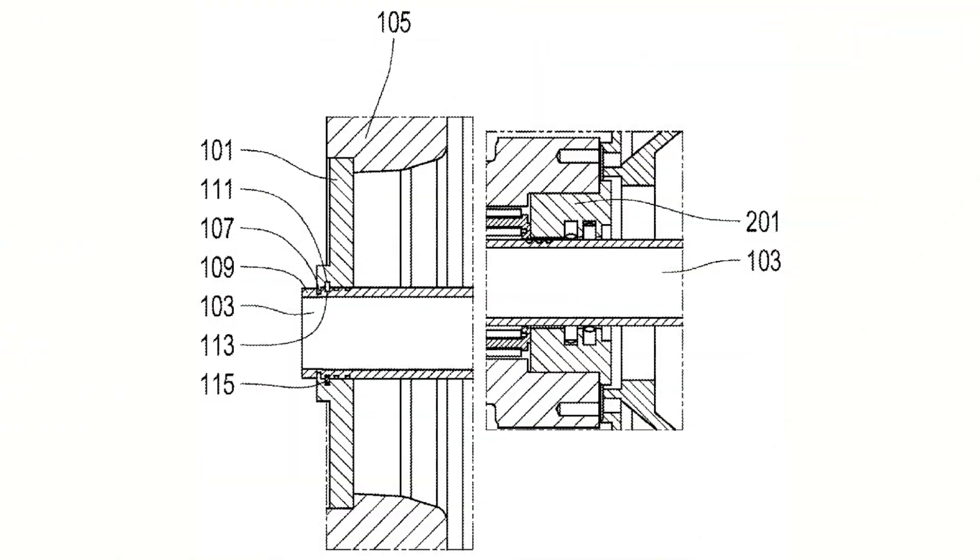Our next idea is from ZF Wind Power and Vestas Wind, and it has to do with gearboxes and preventing stray electrical currents from damaging the gearboxes, the drivetrain, and causing havoc, warranty claims, and other issues. As you pass through a gearbox, there's usually a tube in the middle where you can route hydraulics or electrical signals. However, when you put a piece of metal in this drivetrain, it provides a pathway for stray currents to flow, causing damage to the gears and bearings. This idea from ZF and Vestas takes that tube and makes it out of plastic — a really simple change.